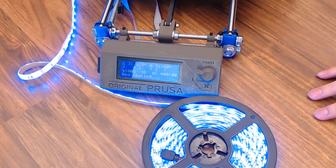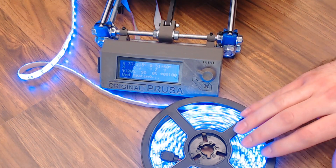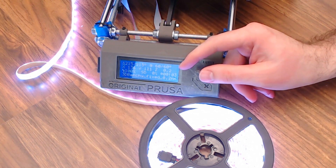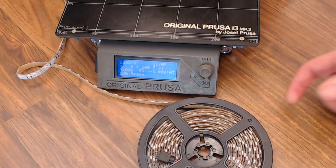When the upload is complete we can start a print. The LEDs will be blue when it's cold. When the bed starts to heat, they go to violet. When the hot end starts to heat, they go from violet to red. Now the bed's up to temp — we're at violet. The hot end's almost to temperature, getting ready to go red. Now we're red — up to temp. When the print starts, we go to white, and we should stay white during the whole print. When the print completes, the LEDs go green, and the LCD waits for you to click to resume. If you click, LEDs go off.